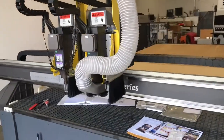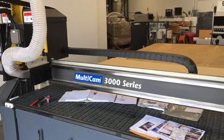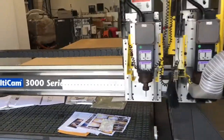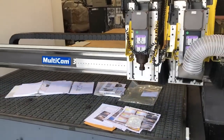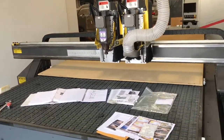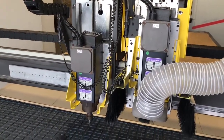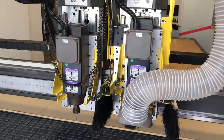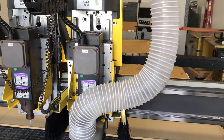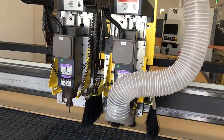This is a dual spindle setup with two twin 7.5 horsepower Columbo spindles. Multicam does these right — you can actually use these two spindles in sync so they can create two of the same part at the same time, doubling your production of a standard machine. Or you can control them as completely independent tools, because they have independent ball screws and independent servo drives and motors, so you can use it as a second tool and go from one tool to the other as if you had a tool changer.